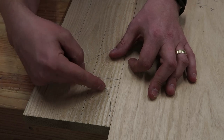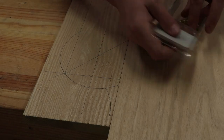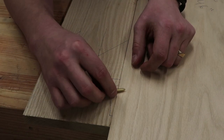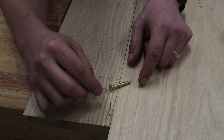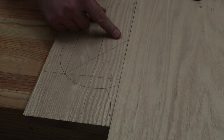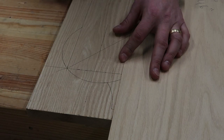When I cut this it's going to be hard to get clamps over on this end to get it to seat well. So what I think I'm going to do is put a nice brass screw in the corners once I glue it up — I think it'll look good there and won't be too noticeable, and should get a pretty good grip to pull it in tight. I'll do that for either end. Now I'm going to cut where the biscuits go, then take it over to the band saw and cut all this out — though I need to change out the blade.